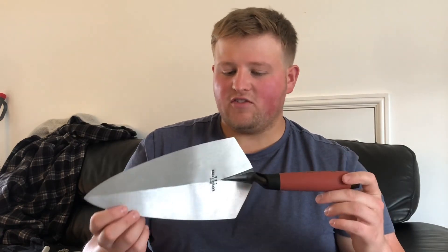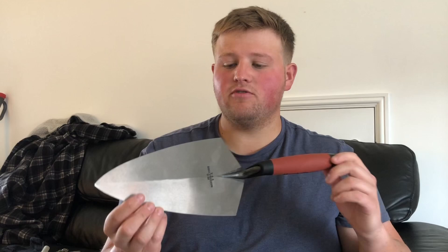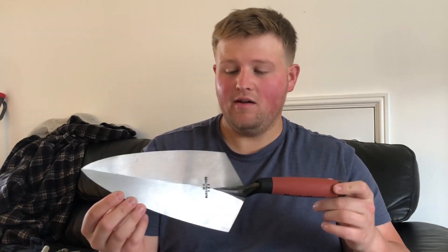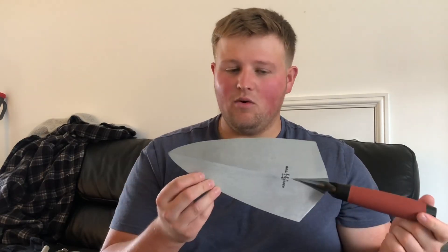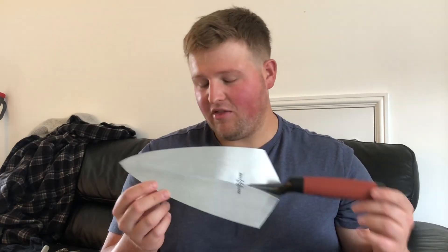In the next few weeks I'm going to be devoting myself to a more traditional style of laying — not running in traditionally, but building more corners in a traditional style using a bigger trowel. The whole point of using a bigger trowel for laying bricks is so you can pick up more mortar to lay onto the wall, have fewer trips to the board, and keep the mortar from each brick you press out for your next perp joint.